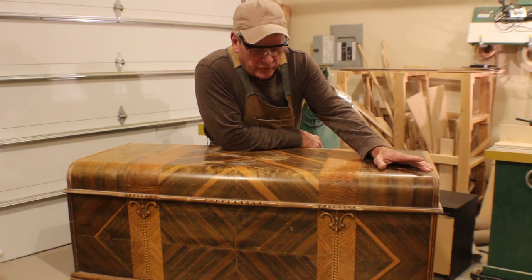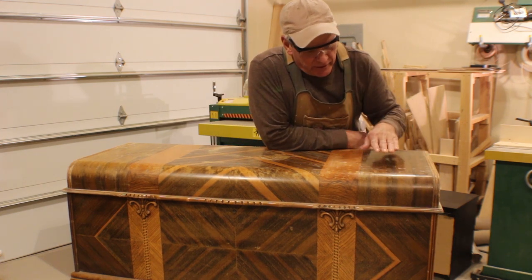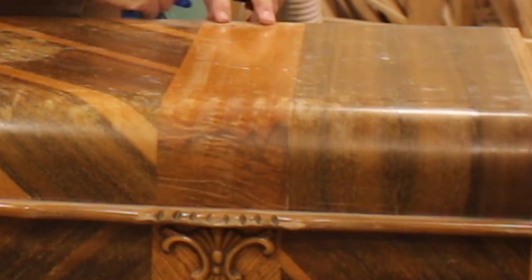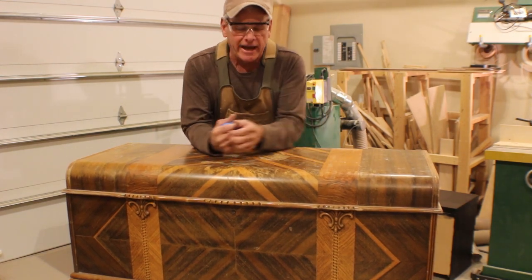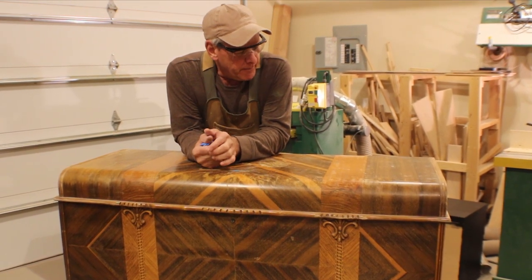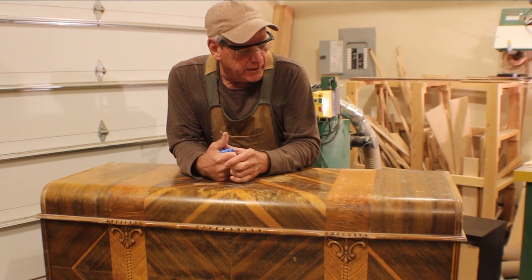What I'm going to try to do is restore some color back to the original veneer. There are a lot of walnut-looking color strips in it and then some lighter, early American-looking strips. This looks like a bird's eye maple veneer in this area. Some of the lighter areas I'll treat with a natural stain which has more of a yellowish cast to try to restore the scratches. But I'm not going to do much to the structure of this veneer, just for fear of making it worse.